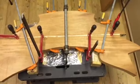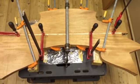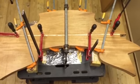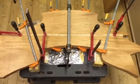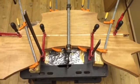Well, we have the trail board basic shape started. Cut out the basic outside and took the bottom part and put it on the top to keep the wood the same. It's good to keep the same type of wood when you're carving a piece, to keep the same moisture and the same grain texture together. So I cut the bottom part out and put the top part.